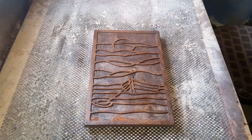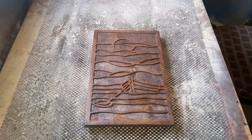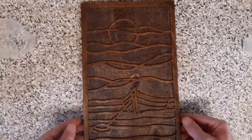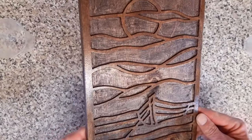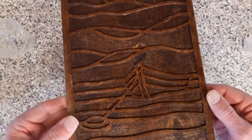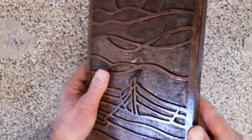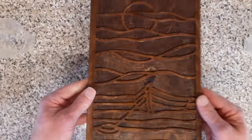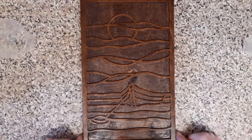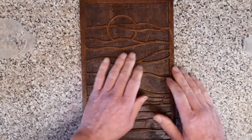Right, we'll come back in five minutes or so when it's all nicely done. And we'll go indoors where it's a little bit warmer and we'll start filling this one in with resin. Right, that's enough varnish for me. It's just enough to give it a nice shine all the way around. You could lay it up a bit more, two or three more coats if wanted, but that's plenty. When we compare the back, which had nothing on, to the front, we can certainly see the difference here. So that's enough for me now. So hopefully we've also sealed this as well as given it a nice shiny finish. Now resin time. So we're literally going to fill this up with resin nearly to the top.